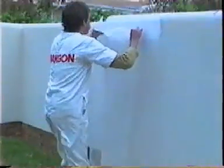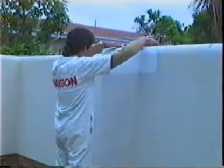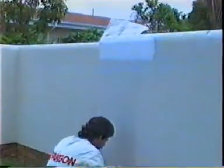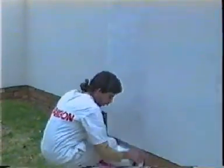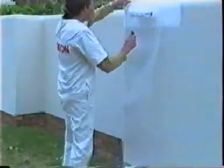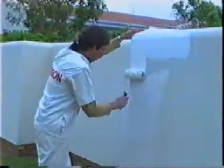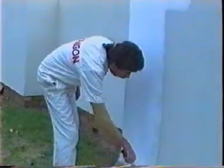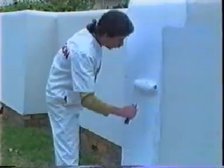Thirdly, lift the Crakgon from the roll and attach it to the wet painted stripe. Ensure that the drop is vertical and even, then smooth Crakgon against the dry surface. Fourthly, paint through the Crakgon. Apply paint generously, as this will stick the Crakgon to the wall.